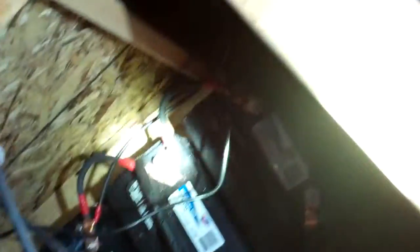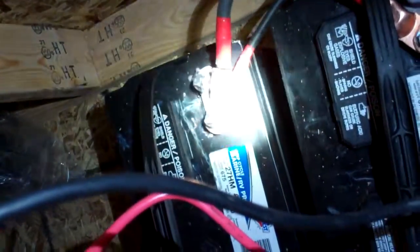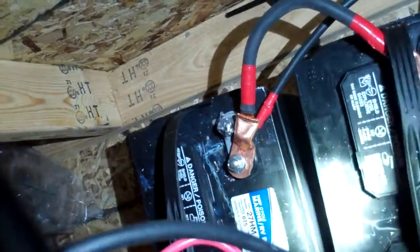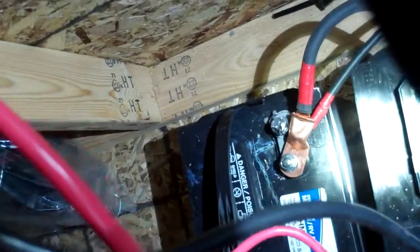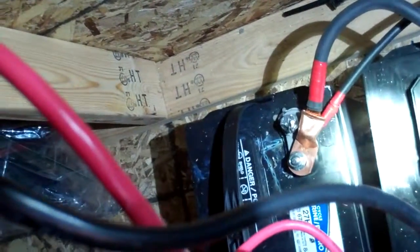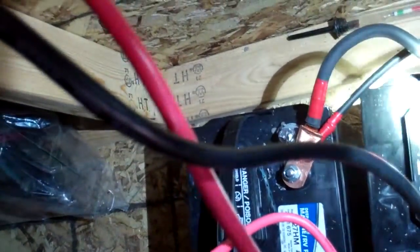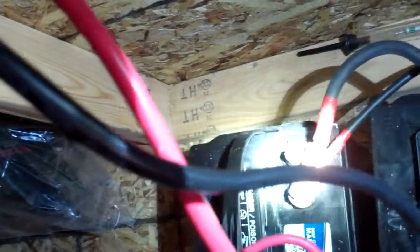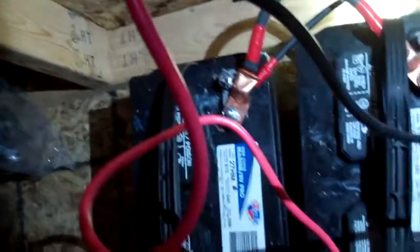There's my three batteries. As you can see from that post right there — if you cross polarities, have two of them right and one of them wrong, and go to connect a third in parallel, exactly that much lead will melt off in approximately two seconds. But that's why this is a test environment. Luckily it didn't fry the battery.